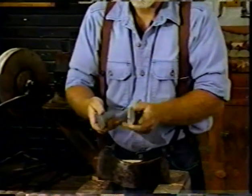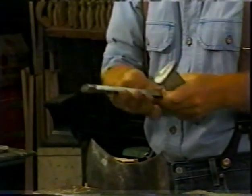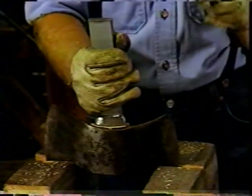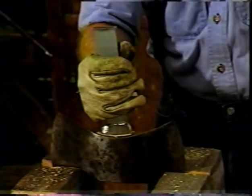The tools to use on this are drifts or swedges. This one's for a single bit — you can see the shape of it is like a single bit. And here's a double bit — put it right on the top like this. Take a hand sledge, about a two-pound, and start to drive it out.